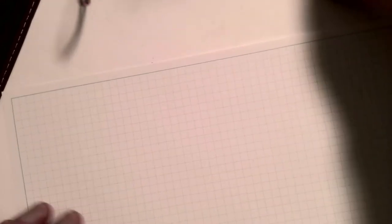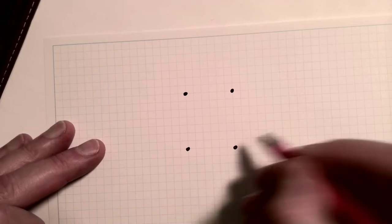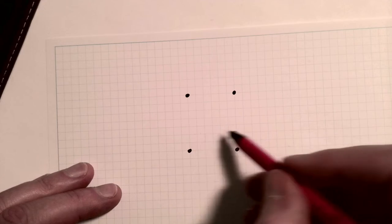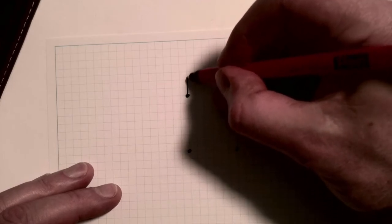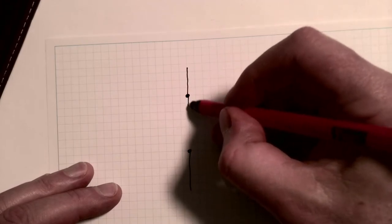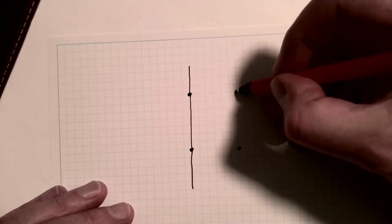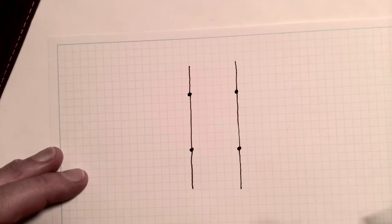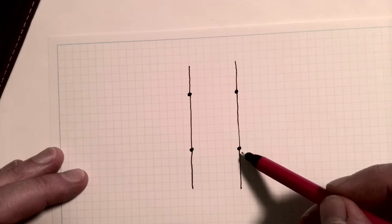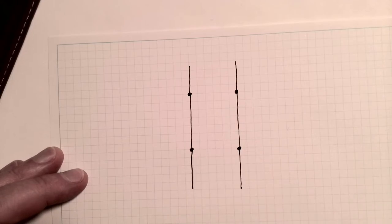So let's see if we can represent that in a drawing to make it a little bit clearer. I've got my top left leg, my top right leg, my bottom left leg, and my bottom right leg. What we know is that if I connect up here to this - if I connect those two legs, they're fully connected and there's no switch between them. If I connect up here and all the way down here, those two legs are fully connected and there's no switch between them. But if I connect to here and here, I have to press the button to make a connection - and the same for any combination across left and right.